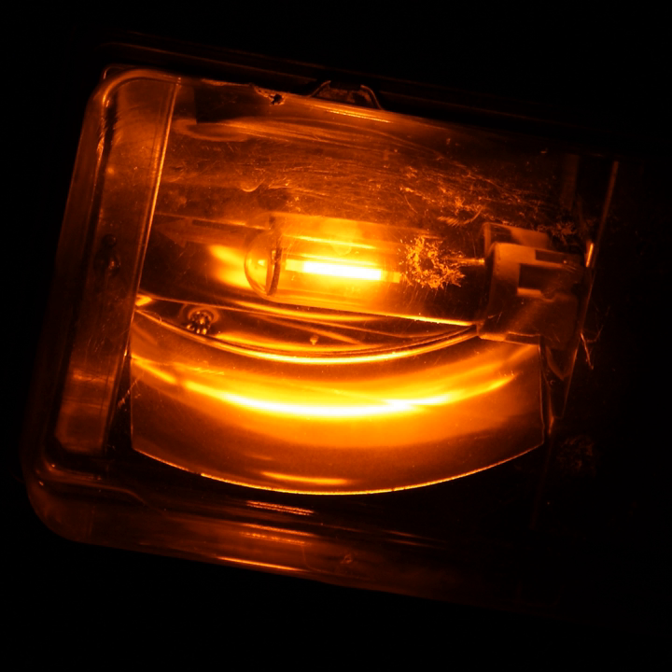An amalgam of metallic sodium and mercury lies at the coolest part of the lamp and provides the sodium and mercury vapor needed to draw an arc. The temperature of the amalgam is determined to a great extent by lamp power — the higher the lamp power, the higher the amalgam temperature, and consequently the higher the mercury and sodium vapor pressures and terminal voltage. As the temperature rises, the constant current and increasing voltage consumes increasing energy until the operating level of power is reached. For a given voltage, there are generally three modes of operation.